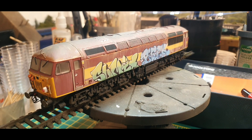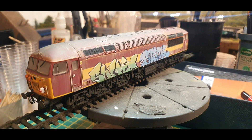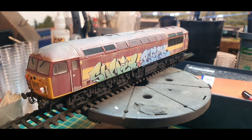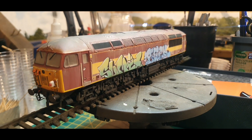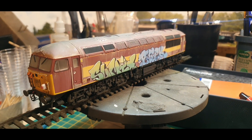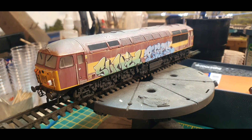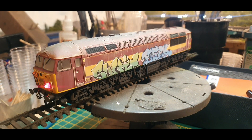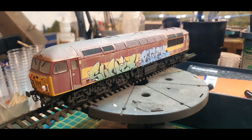Quite simple really — basically just stick it in the middle of your loco with a bit of Blu-Tac so you can change the battery, add two wires, join up the other end, drill two holes in the cab, feed it through, resolder — job done. I enjoyed doing that, that was quite good. I hope you took inspiration from that, and if you need any advice or questions just drop me a line. Yeah, quite happy with that. Okay, see you later.